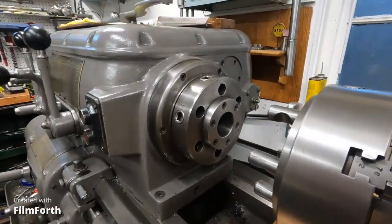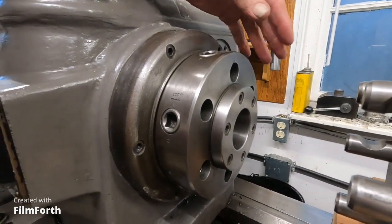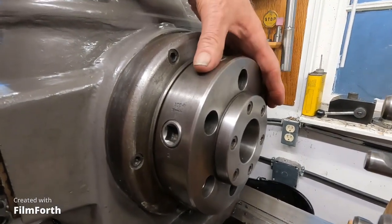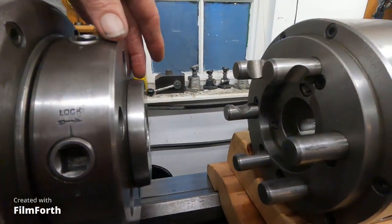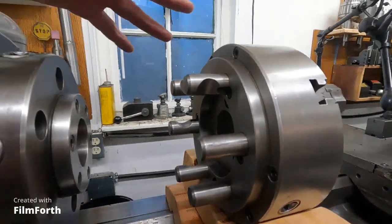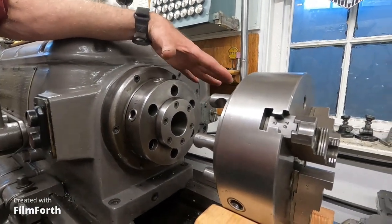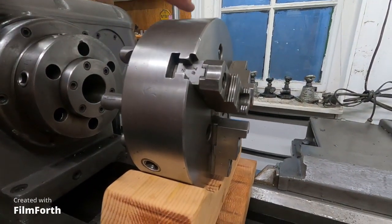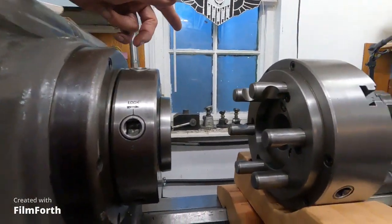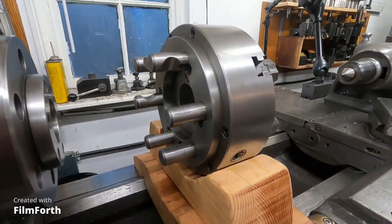The problems with the D-type spindle don't really happen with the L-type or threaded, okay? Just as long as they've got everything square. But the D-type has that problem, and it's overlooked. It looked to me like it was overlooked. They were trying to make this chuck run good, but it wouldn't go on the spindle right or stay the same. They bought extra jaws, got sick of it, and sold the whole kit and caboodle to me on eBay. So now I make this work. That's number one. Okay, I will be back.